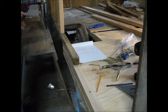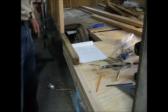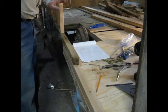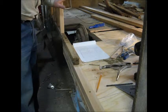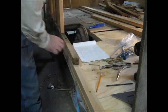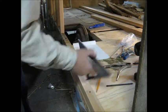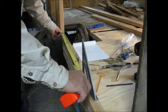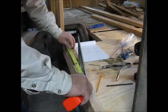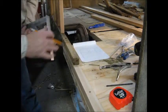Let's lay out the next window. I've got my little drawing here I did before I took any of the old framing down. It looks like we're 24 and a quarter from the inside of this to the inside of our next king stud. Let's get a tape — 24 and a quarter. This will give us an accurate drop. Right there, put a little mark there and square that off.